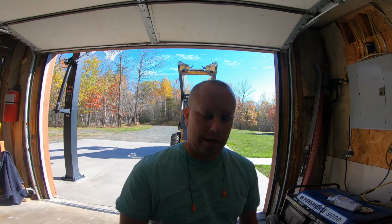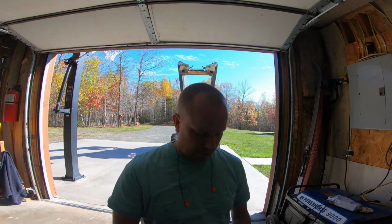And in one of my videos for snow removal, I documented a situation where I had an engine derate code that popped up. At that point when that occurred, it was about minus six. And so I brought it inside. I had allowed it to warm up. Really, that problem probably was more related to the fuel starting to sort of gel up. There may have been a missed treatment on some of the refueling that had occurred.